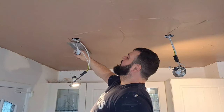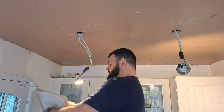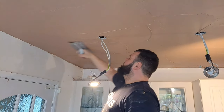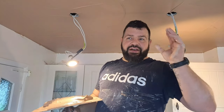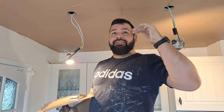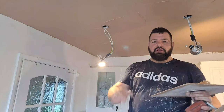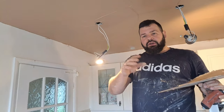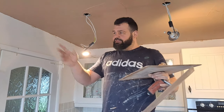Right. Now we're getting back to the start again when I put another coat over. And I'm going to hit it with the Darby. And then, because we've been faffing around with the ceiling, and I want to let the first coat go in first, let it really pick up. I didn't want to put any walls on, so I'm going to introduce you now to a rolling set. So what that means is, it's a gauge that is going to be a number of little mixes of plaster, but all sort of squeezed into one rather than a separate mix for the walls.